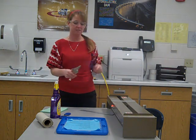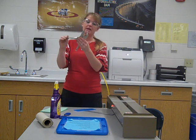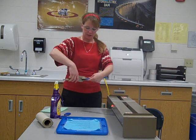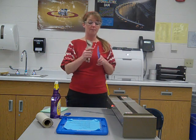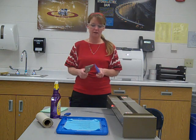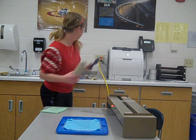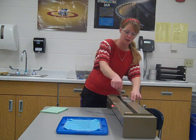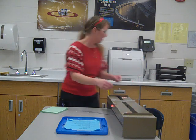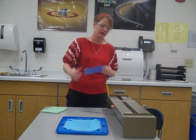If there's only a little tiny bit of plastic that needs to be broken off, use a vice grip. Once you score your line, put the vice grip right on and snap it — it should come right off. But it won't come off unless you have a nice score cut into the plastic. Now I'm going to take a look at my plastic — I'm able to fold it all the way over, which means it's ready.